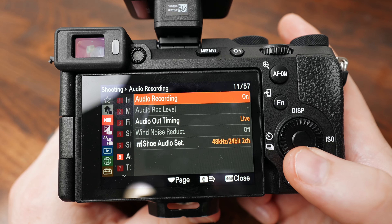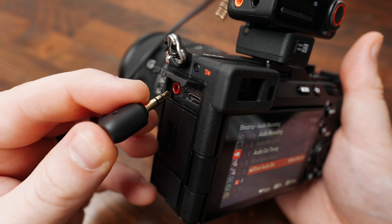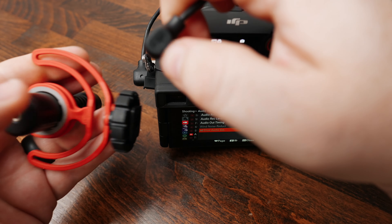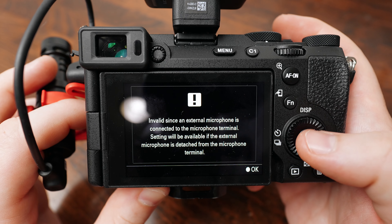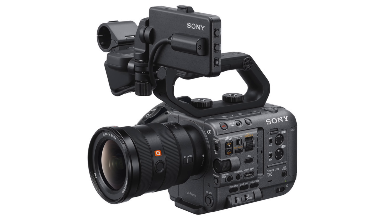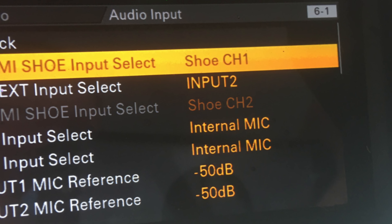This accessory on most Sony mirrorless bodies will also limit four-channel recording down to two-channel recording. So you can't plug in something like a shotgun mic to the external input and take advantage of four-channel recording — this device will cripple that. However, with something like the Sony FX6, a bigger cinema camera, you can take advantage of four-track recording and run multiple shotgun mics for channels one and two, then run the DJI Mic as channels three and four.